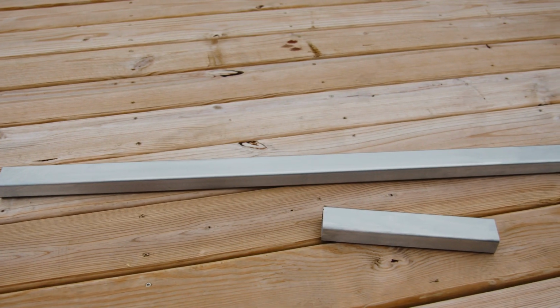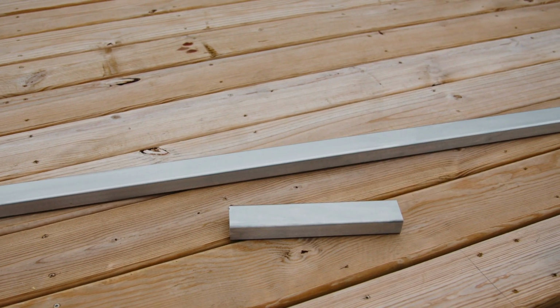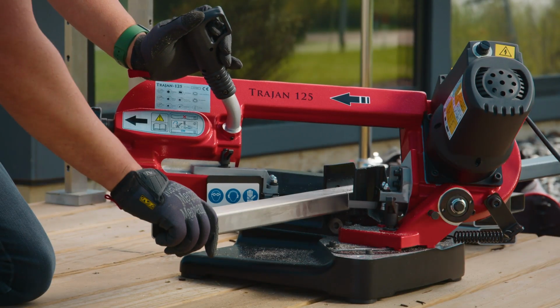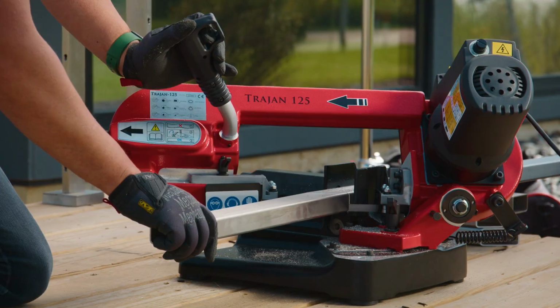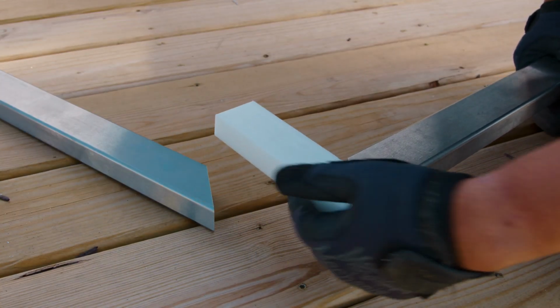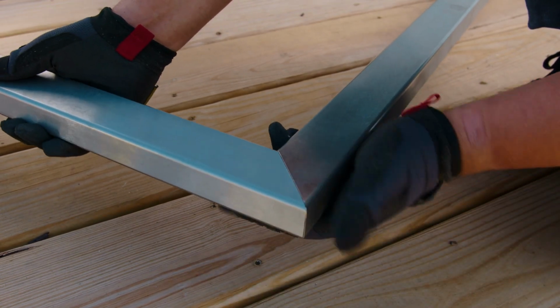Normally we would use the cutoff piece to continue our handrail by flipping it over, but our cutoff is less than 12 inches long. As a result, we're cutting a fresh piece of handrail at the same 45-degree angle. To join the 2 pieces together, we'll take our fixed Delrin corner spline and insert it into the first piece of handrail before sliding the second piece on.